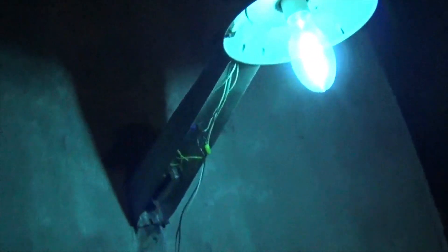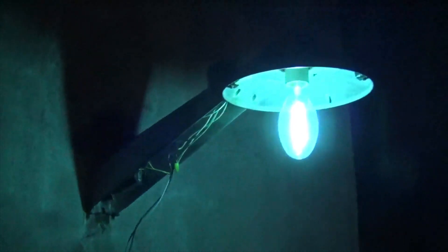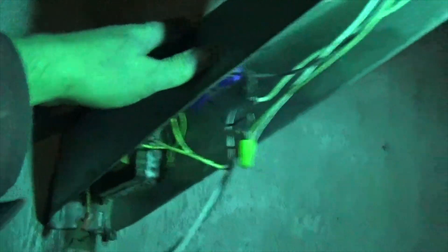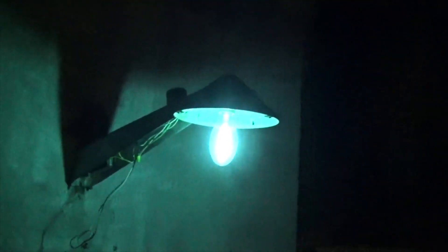So far so good after powering on with the bulb. Still very noisy though - reading 2.14 amps and 67 watts, though I'll need to let her warm up for that to be accurate. The capacitor is holding up, but the light still vibrates a lot - so much it makes the bulb jingle. That's not very satisfactory. It actually got way louder after the first startup - not sure why.